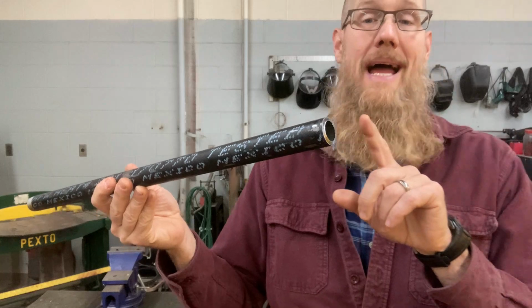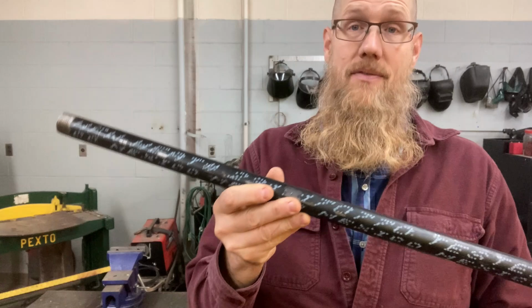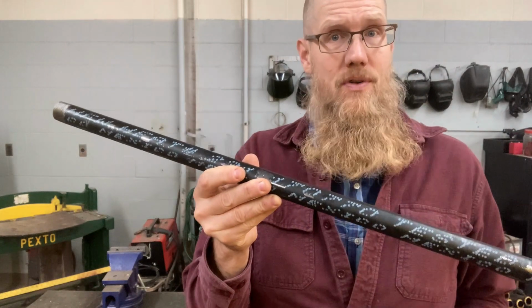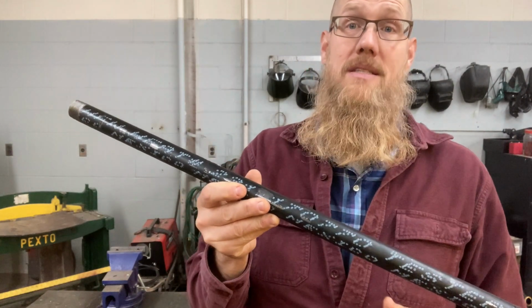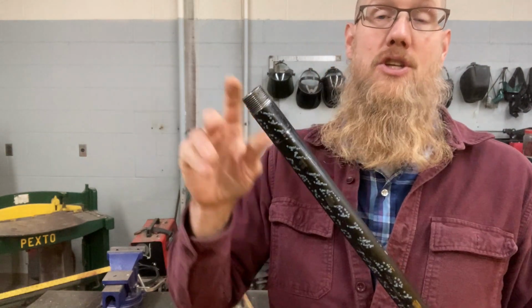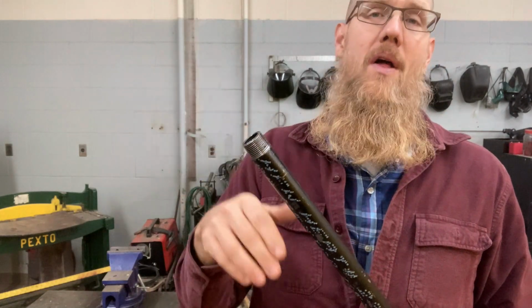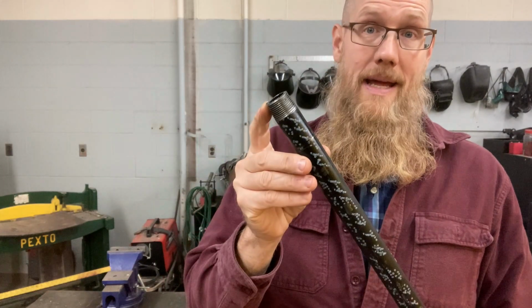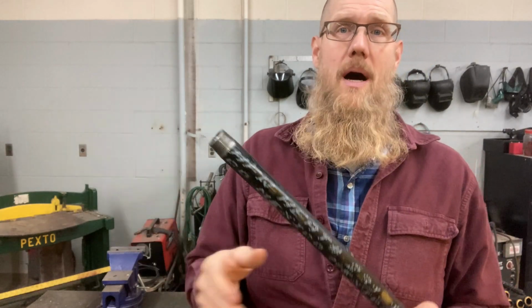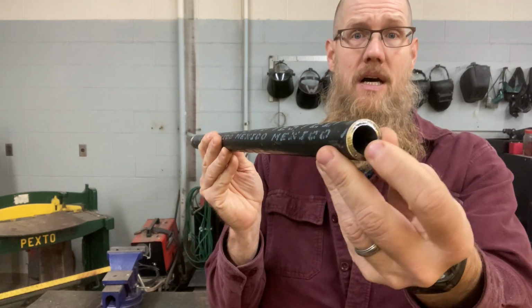What I found to be the most economical is to have the hardware store cut 10-foot lengths. So for this situation, I had 3 10-foot lengths cut to 2 foot, which gives me 15 pieces. The 2 outside edges are already threaded. So all I have to do is have those 3 inside pieces threaded on one end, which is an additional cost. So just cut and then threaded.